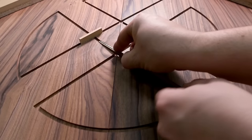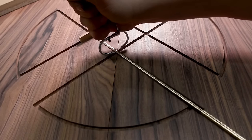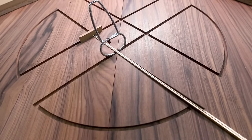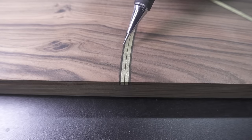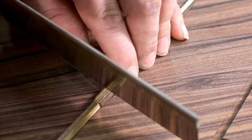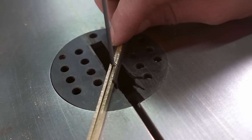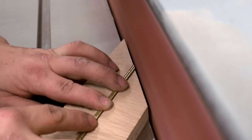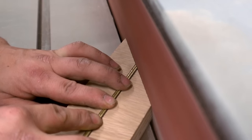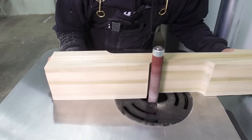Now the first strips can be placed. A perfect way of holding them together is with a miter spring clamp. The orientation is two ebony strips on the outer edges and two strips of brass on the inside, separated by a very thin strip of ebony. To mark where the miter needs to be cut, I use a saw with a very small kerf, then do a rough cut on the bandsaw and slip it into a jig that guides me for the correct angle. This Laguna strip sander makes quick work of refining the angle. Thank you Laguna for providing this awesome edge sander as well as a very quiet spindle sander.